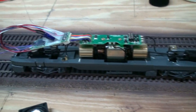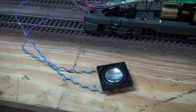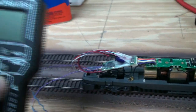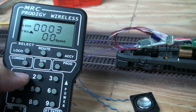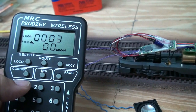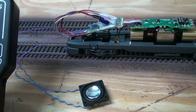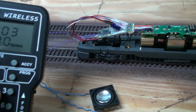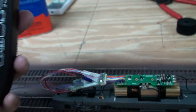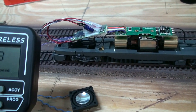I've placed it on the track and secured all the wires to make sure nothing is going to short out with a little bit of tape. The speaker is soldered into its appropriate wires. Go ahead and set your locomotive for address 3, which is the default address. Press 1 twice and it should start up. Now let's see if the wiring is wired correctly — let's go to speed step 1 in the forward direction. Nice and slow.